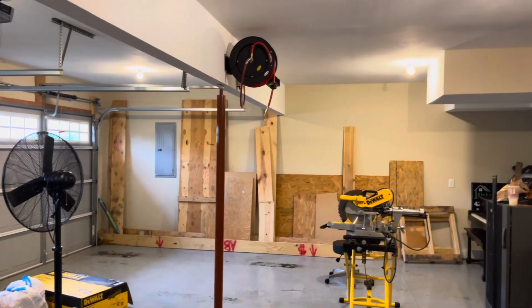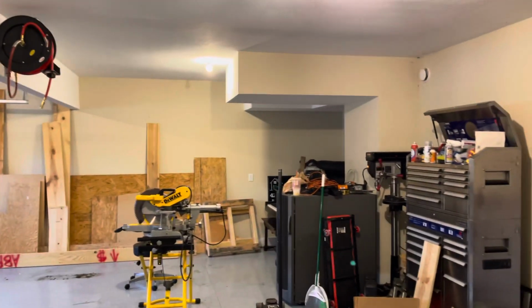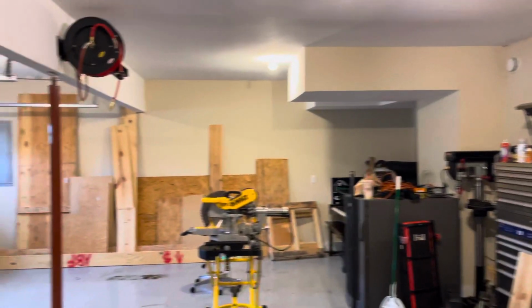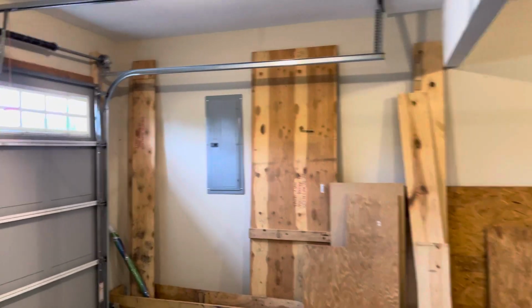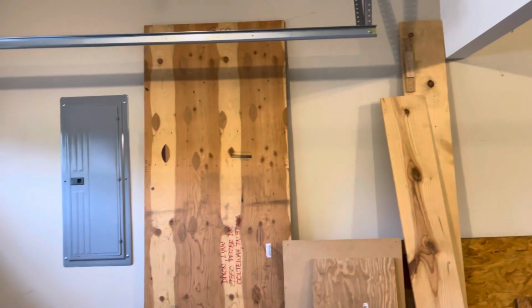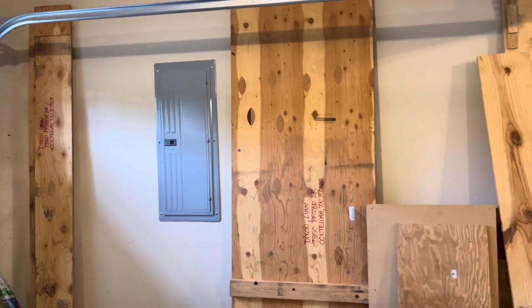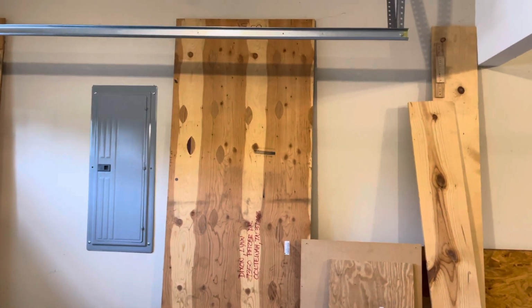That wall right there is an exterior wall, and that is where the main power feed comes in. But I'm thinking probably install the wall connector somewhere along this wall. That way it's fairly close to the breaker. We can run a 60 amp circuit right to that wall connector, and should be fairly doable.